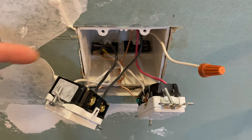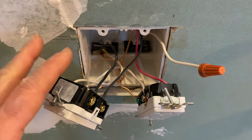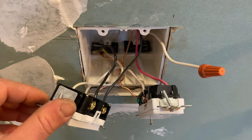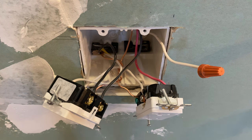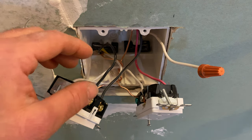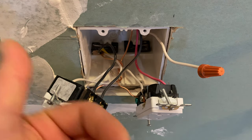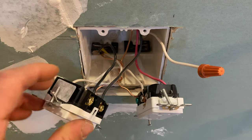The supply line is coming directly from the main electrical panel. I put in a new 20-amp breaker — it's actually a really old panel and the breaker is expensive, around $45. You can find them at Home Depot, Lowe's, and Amazon. I added the 20-amp breaker in the main electrical panel and brought it directly here.